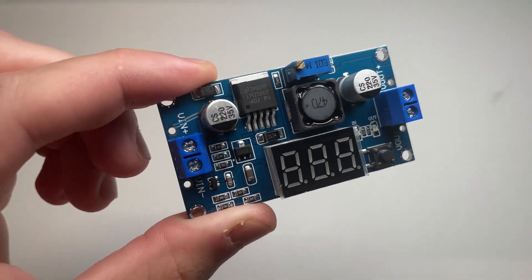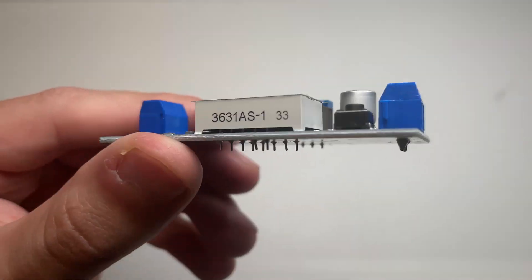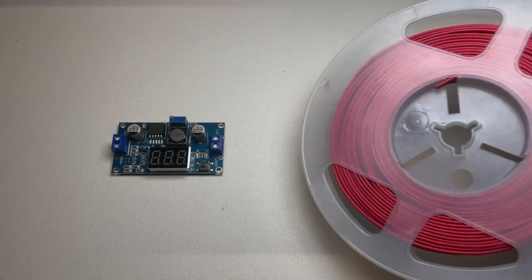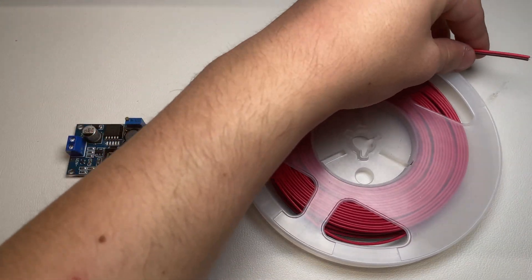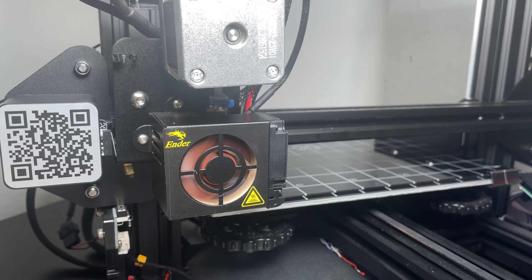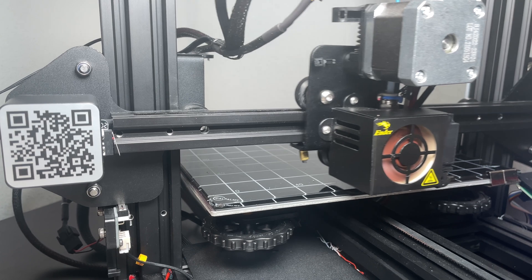The fifth — and last — pieces required to make this project work, especially if you want to change the hot end and internal fans, are a buck converter and wiring to adjust the voltage. The buck converter acts as a bridge that limits the voltage passed through to the fans, since the Noctua fans are rated at 12 volts while the printer uses 24 volts. You do not want 24 volts powering your Noctua fans, as it can cause major damage and issues over time if left unchecked. The grand total for the buck converter and wiring came to about $20 USD.